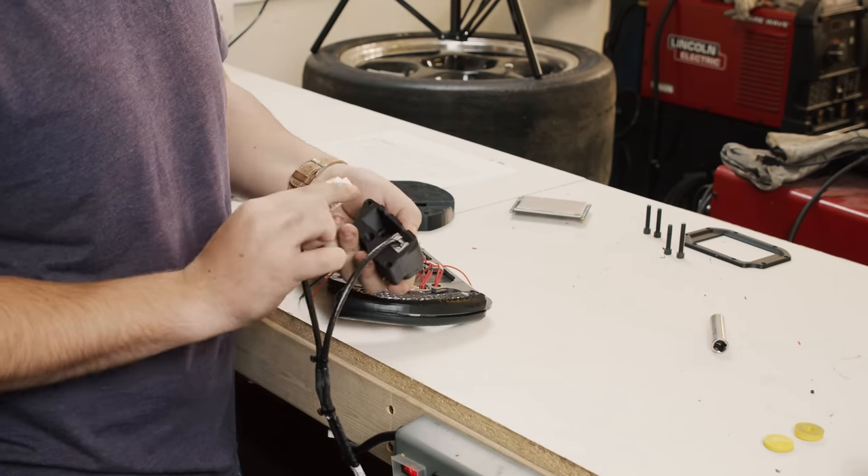The battery is dropping completely to the lowest point in the car. The coolant lines are running on the outside of the car now instead of on the inside. The radiators are interesting — I've left enough space if I want to upgrade to larger custom-made aluminum radiators. Those are still the factory Porsche Boxster ones, and I kicked them at quite a bit of an angle so they'd fit under the nose cone a little bit better. This is a significantly larger motor, but we also have an oil cooler, so there's an option of stepping up to bigger radiators if we need.